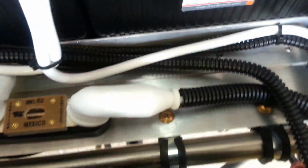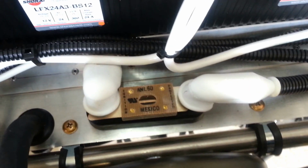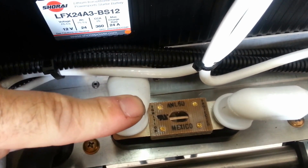If you take an overview of this electrical system, you'll see that there's a path to it. All the wires leave the battery, and then they cross over to the engine in one location, and then the alternator is, as we saw over here. Now let's just focus on the alternator. The cable goes here, comes over here. Now, as you can see, the alternator fuse that is on the website in the wiring diagrams is located right here. It's a 60 amp fuse.